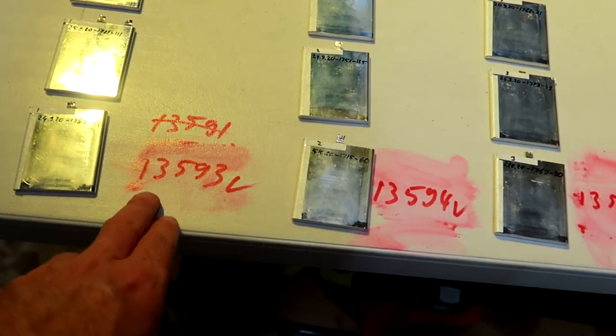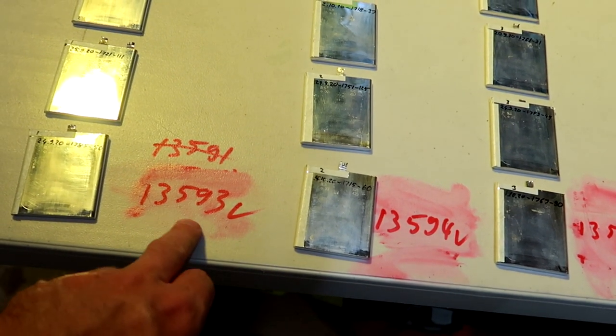I'm very, very sure, I'm 100% confident the website will do a much better job than this one here. And it will also take less time to get this all organized. It will be more precise, but let's see, maybe this is already good enough, I don't know. So probably this all took me now 1.5 hours all in total to get this all balanced and configured. I think the website won't take that long. But all in all, I'm really impressed with all this because we're getting 13.6 ampere hours out of these batteries here. So this should work a lot better in our solar system.